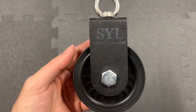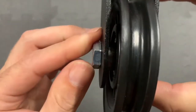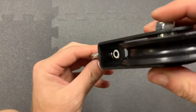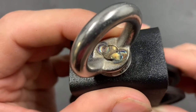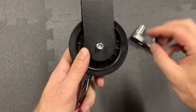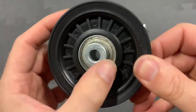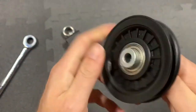Next up is the pulley. It has a plastic wheel that spins quiet and smooth. The hook on top is stainless steel and rotates freely on a bolt for an axle. It has spacers inside to keep the wheel centered, and there's a nylon locking nut on the other end to prevent it from coming loose. The lifting bolt has a stainless steel bolt on the inside whose head won't pull through, and the end of the bolt is welded to the lifting hook so it'll stay secure. Disassembling it, we can see sealed-for-life greased roller bearings — quiet and smooth — with a machined spacer on each side pressed into the inner race of the bearing. Everything is tight and assembled well. As a mechanical engineer, this is a good design. The advertised rating for the pulley is 400 pounds.